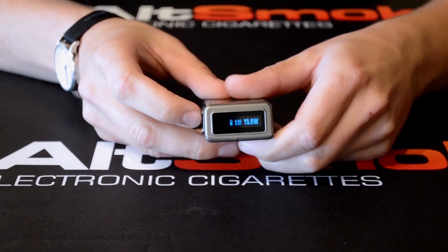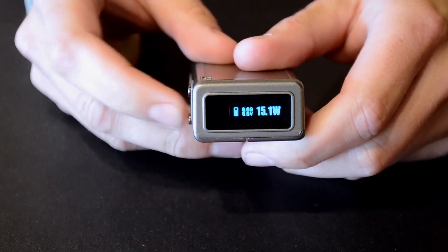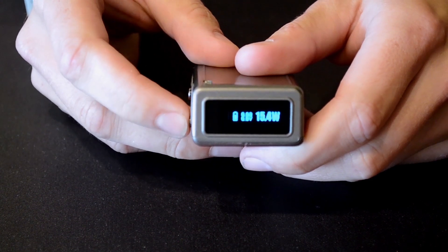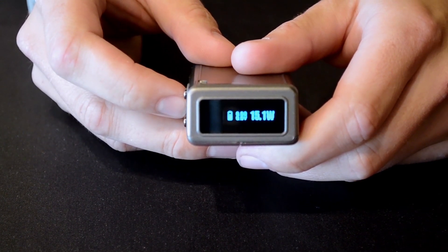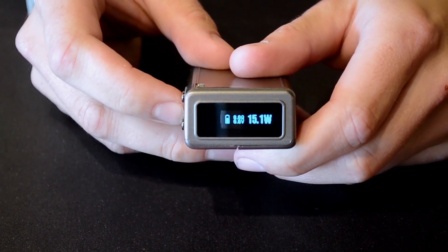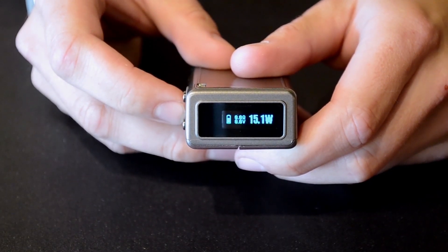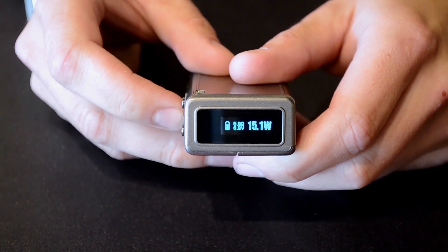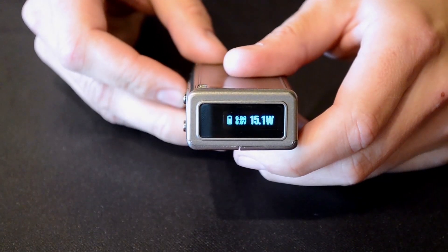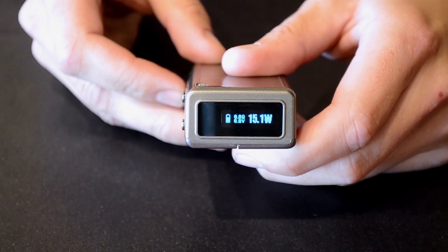Here on the bottom interface, you're going to notice once you press one of the buttons the screen will light up. You can adjust up on the wattage or down on the wattage. You're also going to notice two other options on the interface. One of those options is an ohm reader — it will tell you whatever your resistance is on your atomizer. Right now mine is at 0.8. When you hold down the firing button, you're going to notice the other reading telling you what the voltage is set at.